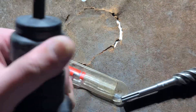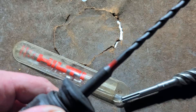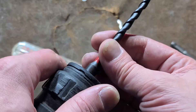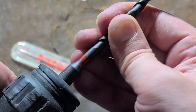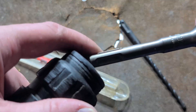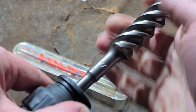It's really old — it doesn't even have the push-in where it automatically locks. You have to actually pull the collar, get it kind of lined up, and release it. The chuck is actually quite deep on this Milwaukee; you have to really shove the bit all the way in. This bit will work in this old Milwaukee because it is a ball drive, if you can get it in the right spot on cooperative old rotary hammers. You can use the new bit in this old rotary hammer.